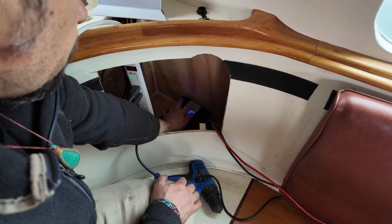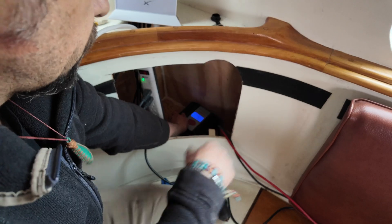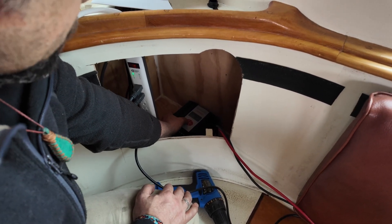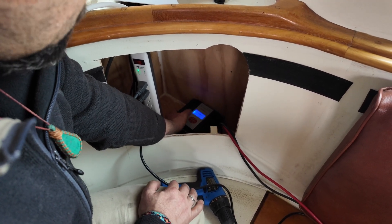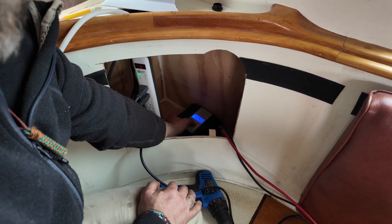Now that I've installed the 50-amp fuse for the wind turbine, I can connect the charge controller to the battery. In a moment I can show you the lithium battery charge controller from the wind turbine. The really important thing is that we first connect the batteries before we connect the wind turbine — because if the wind turbine starts spinning like crazy and puts out very high voltage and it's not connected to the battery, it can destroy the charge controller. Now here I have the wind charge controller — it's actually wind and solar, but the solar is already hooked up with a different charger. With this, I can see how much wind and how many amps we're getting.